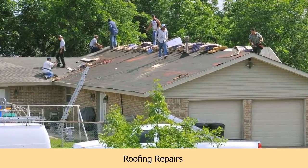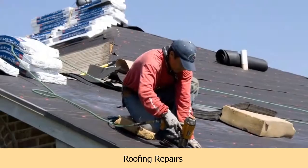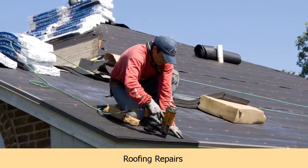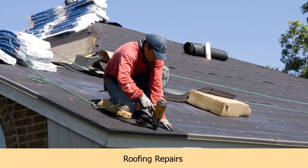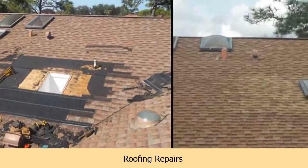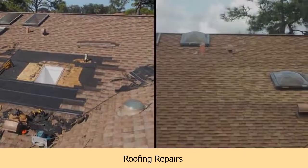There are different types of boarding. Typically roofs either have chipboard or tongue and groove decking. There are other types out there, but this is what you usually find on older flat roofs, with chipboard being used on the majority. Nowadays OSB decking is used as it doesn't swell and soak in moisture, unlike chipboard.